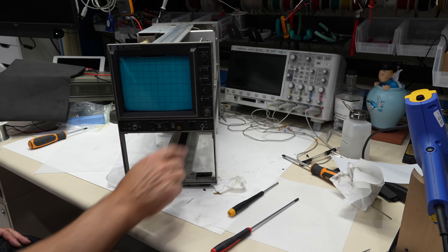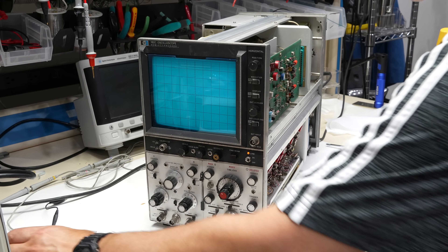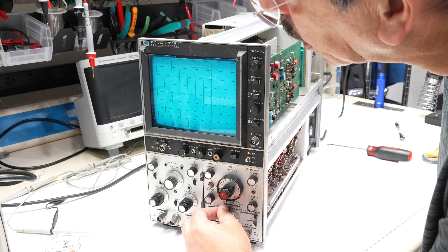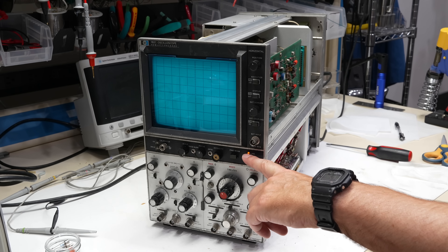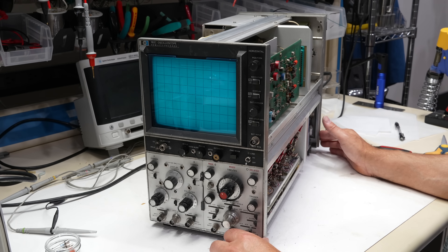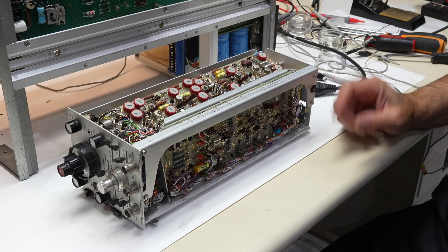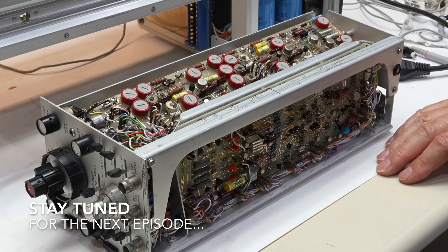I don't have any plug-ins, so I can't see anything at the moment. But plug-ins are what we do next. After replacing all these components, we finally get to where we want to be, which is repairing the trigger. There must be a line setting — nothing. So the trigger is not working, which is going to be amusing, because the trigger on that one is particularly tricky with the infamous tunnel diode system. We finally fixed our oscilloscope mainframe after a high voltage power supply disaster. Wait until we deal with the 1966 vintage dual time-based and triggering plug-in with a million transistors. Entertainment and more HP circuit wizardry guaranteed as we push on to get the scope back to perfection. See you in the next episode!